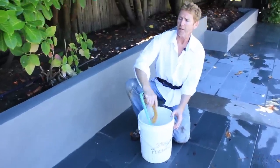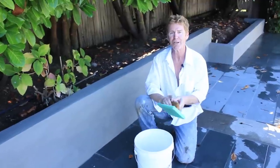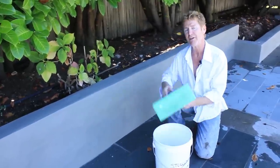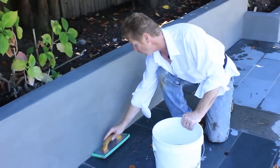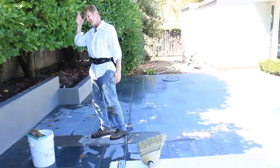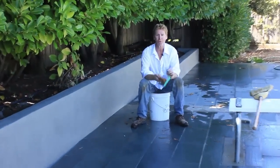All right, guys — we are complete. Generally I haven't used this hand-mixed system in 15 years; the reason is aggregate. You want bags that are already pre-sized with the sand — that way you're not here all day. It took me an extra two hours just because of coarse grains of sand, but you can't blame anybody; that's what happens when you buy from the material yard. Last thing: take your green sponge float and give a clean line, flip it, clean it, and that'll give you a six-inch window. Then take your water hose and clean it up. My name is Kirk — it's been a long day, Jason's on the camera and he's tired too. Thanks for watching; we'll see you on the next one.